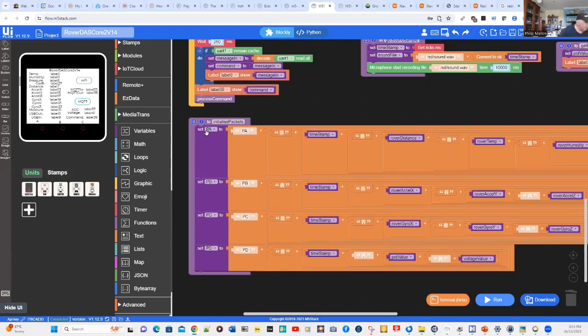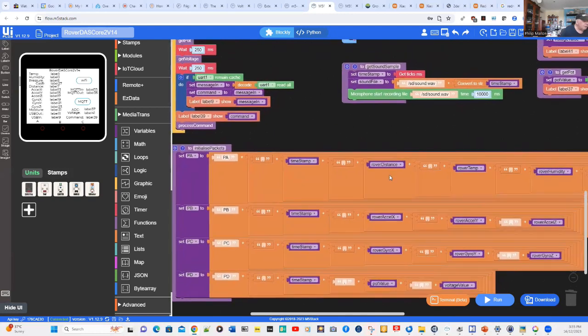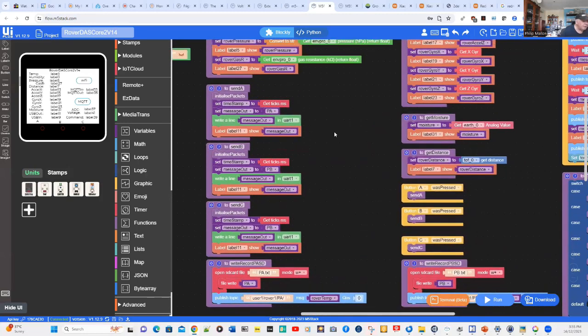There are four of these here, and the first three correspond to the buttons. If we press a button, we can transmit the data by MQTT or the serial port to a Windows PC. This is the packet, and it's in comma-separated format, similar to CSV for Microsoft Excel. And here are some of the other commands for processing buttons and functions for sending commands.